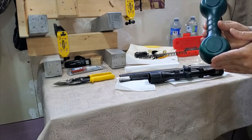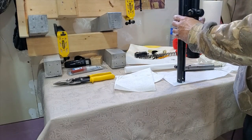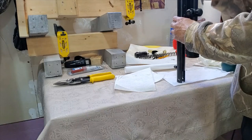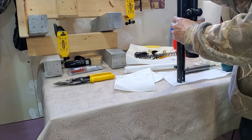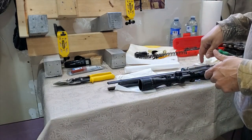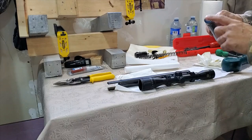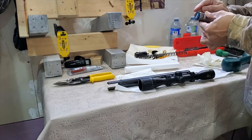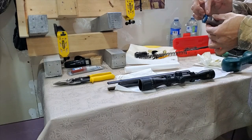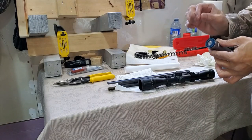The weight fortunately has a cap. I want to make sure when I place the piston like this and put this weight on top, the seal should just slide — it should not drop by its own weight. I will do that in the process to see how much weight it takes. If it goes down easily, I don't have to do anything to the piston seal, but if it is harder to push in, I have to remove a little bit of the circumference — very, very little.